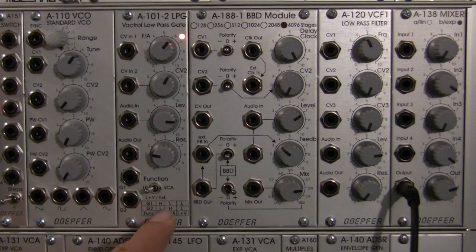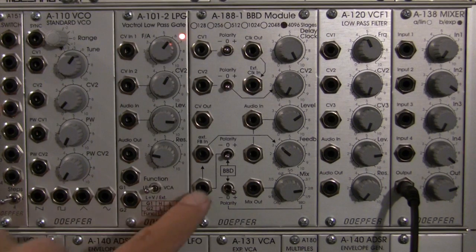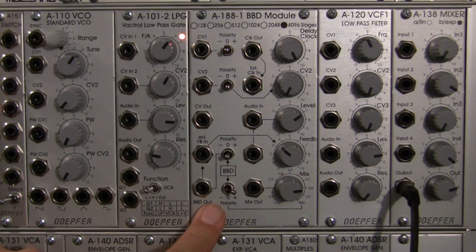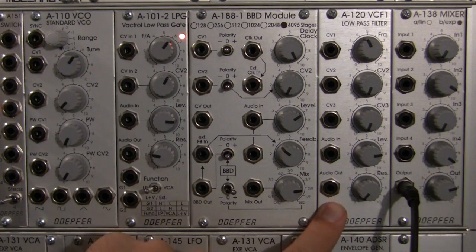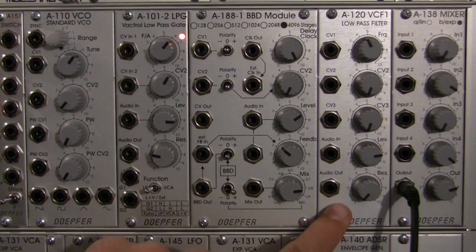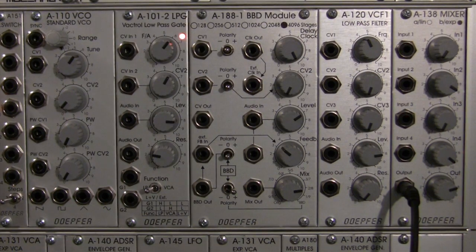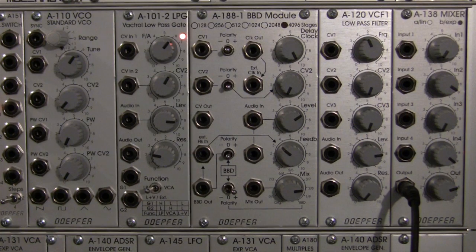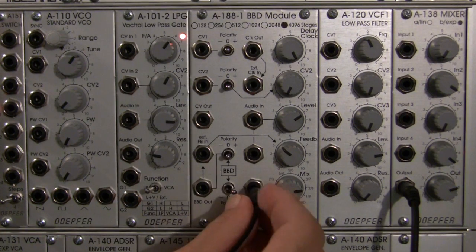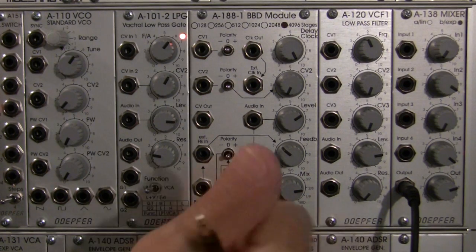And then it's going to go — so back up just a little bit — sound source to filter, into the BBD module right here at the input. And then it's going to go into a second filter. It's what's recommended to filter out any additional clock noise or distortion that might be generated, and then straight out to your mixer. So the first thing we're going to demonstrate is actually the clock noise. Let's hear what that sounds like, because we've talked about it in demonstration one and now we're talking about it again. Let's hear what this clock noise sounds like.